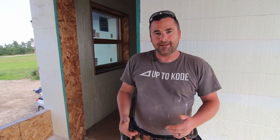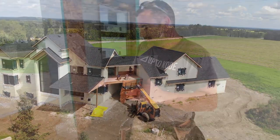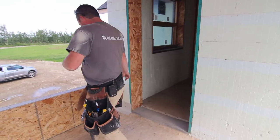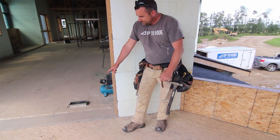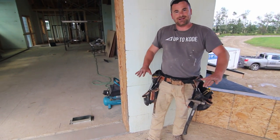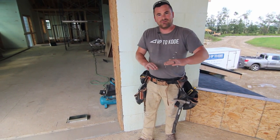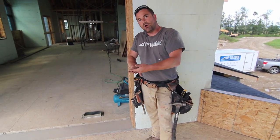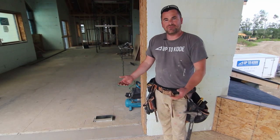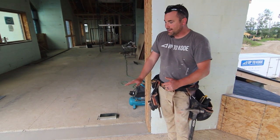I think when you follow through the video, you'll see that I'm doing an okay job — at least I'm trying to be mindful and thinking ahead. What we're looking at today is the breezeway from a house to a detached garage. We have a little bit of a curb or step there, and same thing over here — an inch and a quarter step. Typically the vinyl deck guys want a two to three inch drop down, but the customer didn't want that big of a step. It is better to stop water from infiltrating through the bottom sill of your doors, but the customer just wanted that minimal step difference. So we dropped it down an inch and a quarter — I wish we would have done a little bit more.